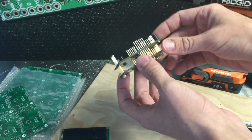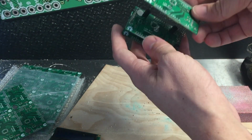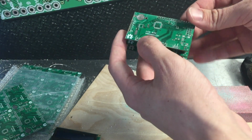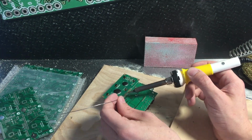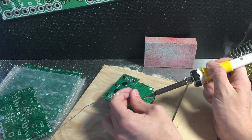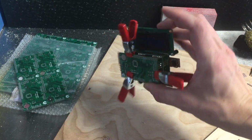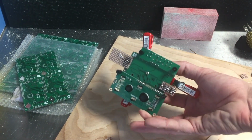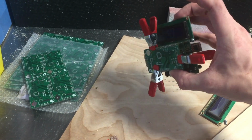In order to test the boards going to the kit, we need the pogo pins to connect to the LCD and to the button board. So we flip the jig over and mount 2 tested boards to the bottom. Once the 2 boards are mounted, ProtoSnap boards are used to break out the ISP header for burning the Arduino bootloader, and the FTDI header for programming the board with the alarm clock firmware. Now we are ready to test the first board of the batch.